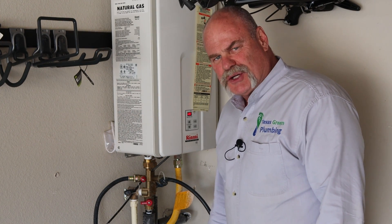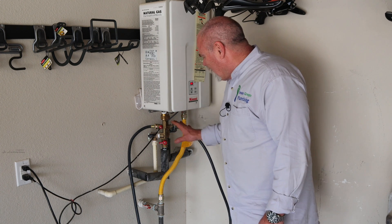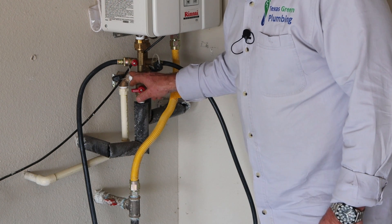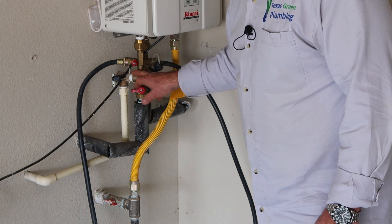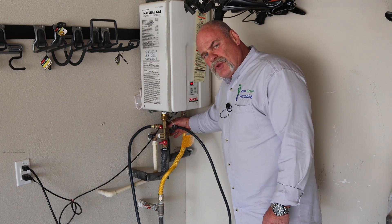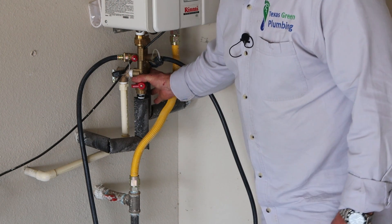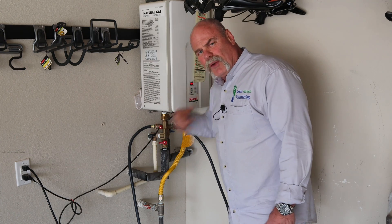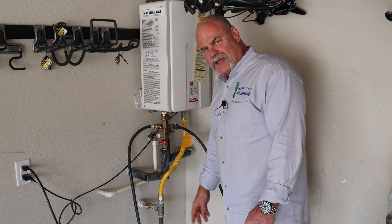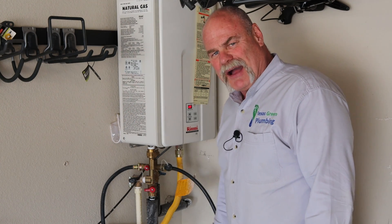One thing to look for before you decide to flush your tankless water heater is you've got to make sure that you have flush valves. What I like about this assembly is on the hot side, you've got your flush valve and your adapter for your temperature and pressure relief valve — I like that it's all built in. Then over on the cold side, you have your adapter for your flush valve. These are very important because you need to shut off the water to the rest of the house, because you don't want this chemical going through the entire system. All we're trying to do is flush the tankless water heater, then we'll rinse it and purge it before we finish, and then put everything back on line.